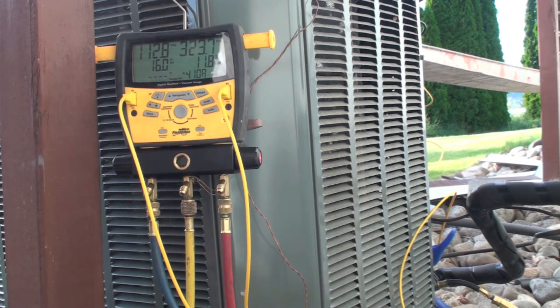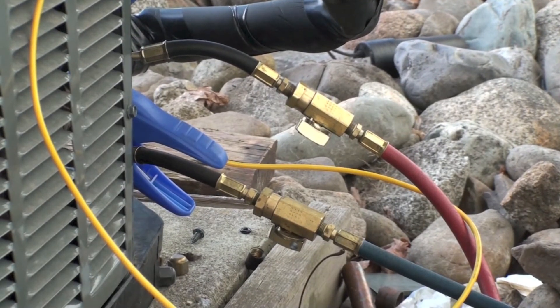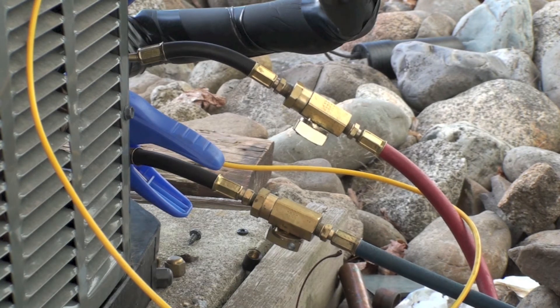There's a way you can do this without getting a frostburn on your fingers. I'm showing you a set of hoses — they have valves on their low-loss fittings. It's one of the types of valves we can use to do what we call low-loss. If I want to get the liquid refrigerant out of my gauge set and out of my hoses, it's really pretty simple: I go to the red line.